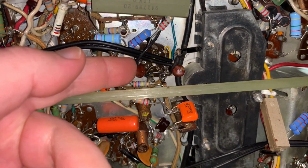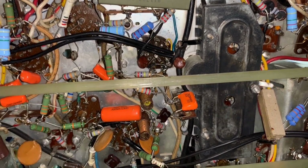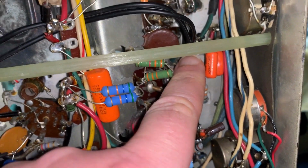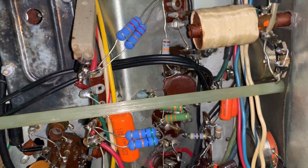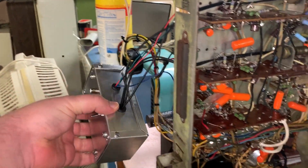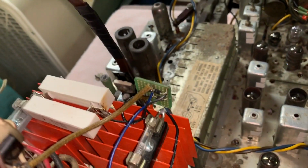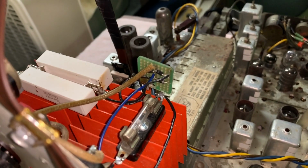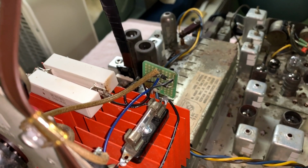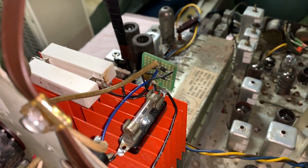This is the first video amplifier tube connected to pin 2. Down here, this little mess here, it's really hard to show because everything's so cramped. That's for the audio. And like I said, this is just enough wire so I can mount it on the back panel. Wanted to keep the run on this short. So, final connection made with the blue wire to my little rectifier board to the -30. So that's it. It's time to put it in and give this thing a test drive.